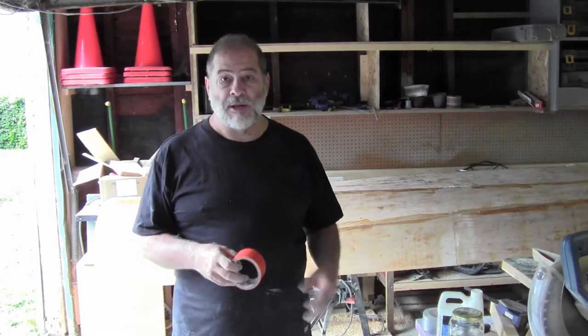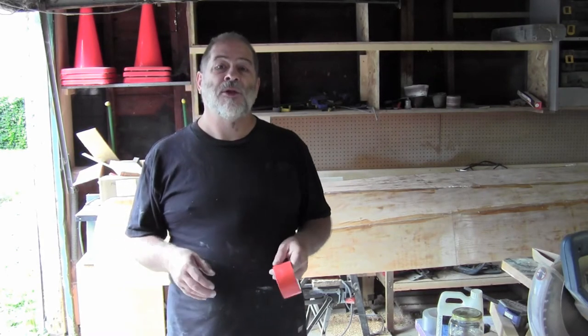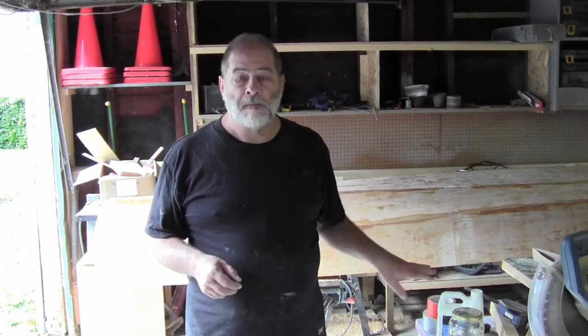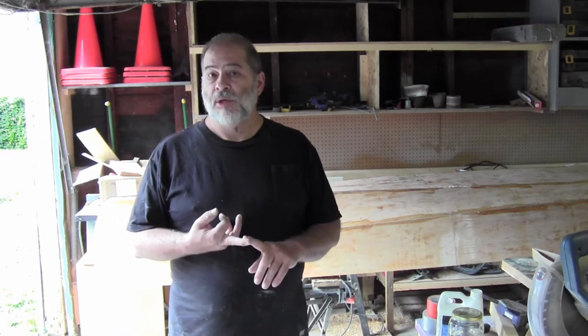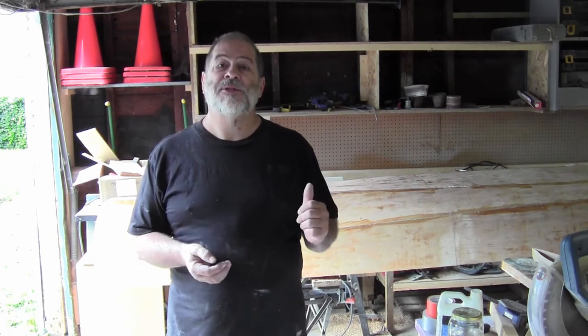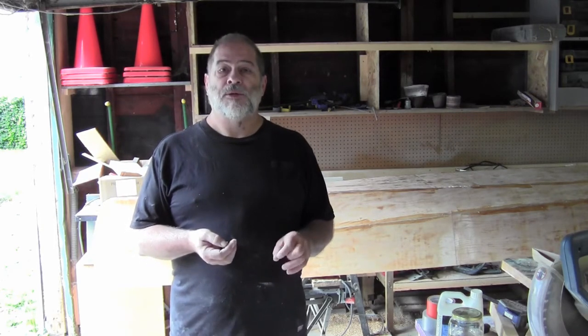Anyways, all I can tell you is chunks of duct tape glue, clots, have stayed on the boat, and removing that is becoming a problem. Now let's not forget, I don't want to stain this boat, so I can't use a remover that's going to stain the boat and leave a permanent discoloration in an area. For example, I can't use water, because water does discolor this stuff. I can't use oils, so I'm limited to products that evaporate completely.